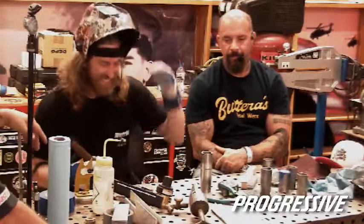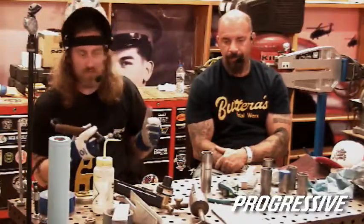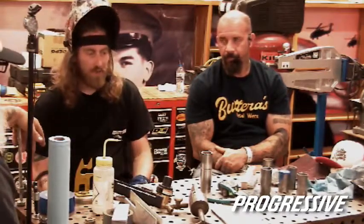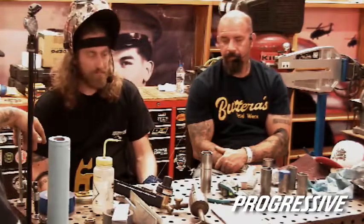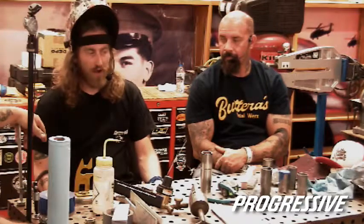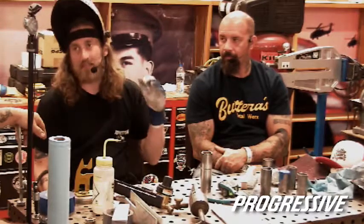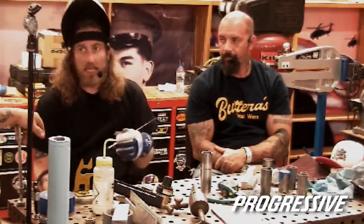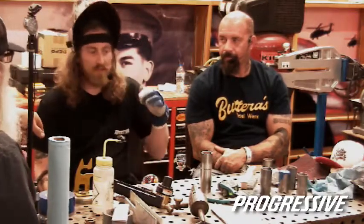So with stainless, it's one of the metals that you can actually fusion weld, and it's a pretty substantial weld because of the properties in it. But it all depends on what it's for. Exhaust, yeah, with good purge and good penetration, it won't crack. But structural welds, you definitely need filler. You can get fusion tacks to start, which is kind of nice because they are sunken in, and you won't notice them as much when you run over them. It won't be a humped bead if you're trying to dab the same amount.